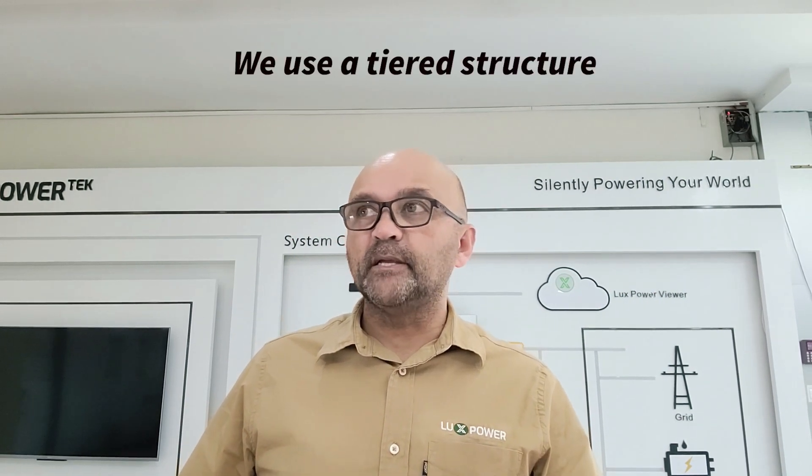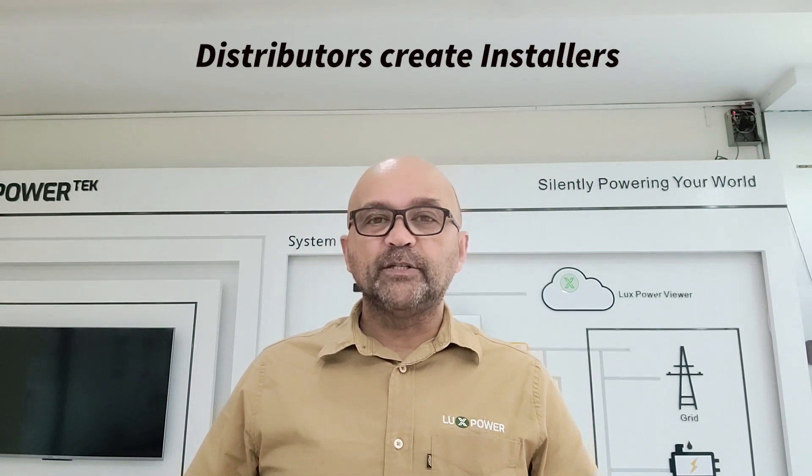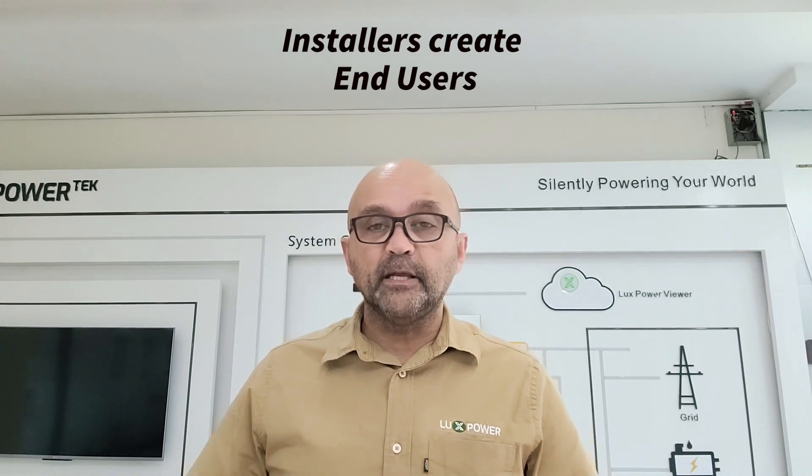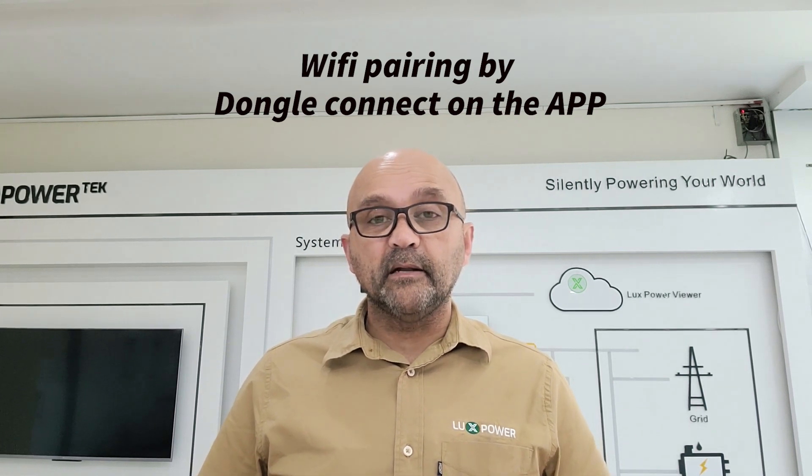If you do copy a generic code, it simply means that the owner of that code will be able to access your machine from their device and change things on your settings page. So, once you've created and registered the station, the final step is to follow the Wi-Fi module pairing — exactly as we've done it in the video. It's connecting your mobile device to the Wi-Fi dongle, then allowing the TCP setup to be done so that you can pair it successfully with the customer's Wi-Fi. Sometimes you might find that the dongle doesn't connect very well with your home Wi-Fi even though you can pick it up on your mobile — this purely means the signal strength of the Wi-Fi in the area is too weak. In an advanced step, I will show you how to log into the Datalogger IP address and how to check the signal strength of the Wi-Fi.